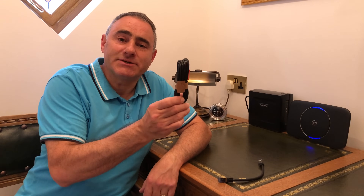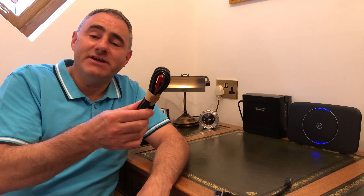The reason I didn't use the patch cable that was sent to me is because it's a CAT5e cable and I've got a network system wired in CAT7 — I wanted to keep everything consistent. A CAT5e cable transmits 1GB over 100m, while a CAT7 transmits 10GB over 100m. The bandwidth for CAT5e is 100MHz and for CAT7 it's 600MHz. The CAT5e cable is marked UTP — unshielded twisted pairs — while CAT7 is SFTP, shielded foil twisted pairs, where the foil around the twisted pairs prevents electromagnetic interference and alien crosstalk. When you use a shielded cable it needs to be properly grounded. You wouldn't generally wire a network system in CAT7 in a domestic property, but it was my choice.